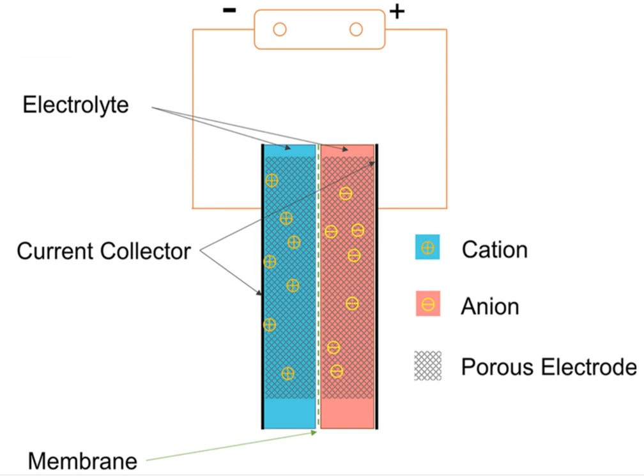Internal resistance. Discharging a supercapacitor is connected to the movement of charge carriers, ions in the electrolyte, across the separator to the electrodes and into their porous structure. Losses occur during this movement that can be measured as the internal DC resistance. With the electrical model of cascaded, series-connected RC elements (resistor, capacitor) in the electrode pores, the internal resistance increases with the increasing penetration depth of the charge carriers into the pores. The internal DC resistance is time-dependent and increases during charge-discharge.